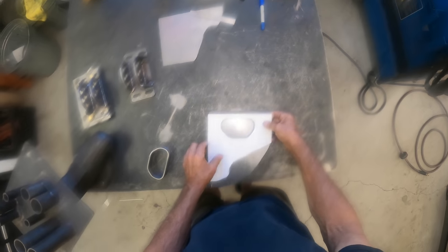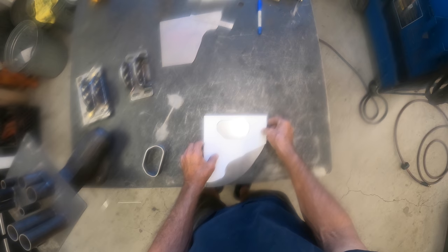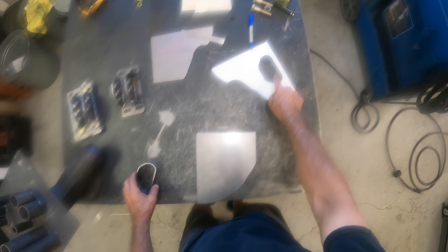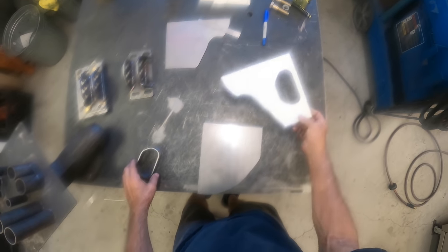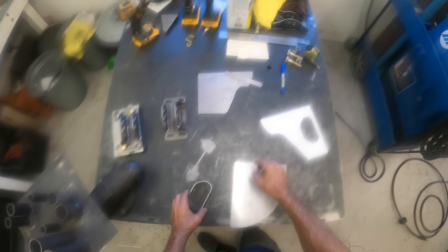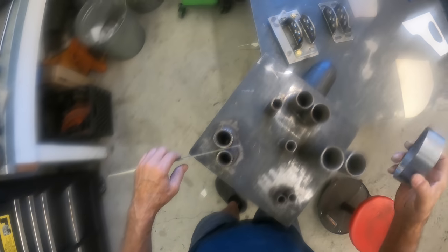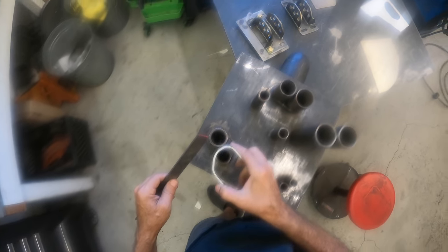Then you draw in the template on a piece of steel. This is an exact template from here, and I'll explain why. So you have something to copy. So you have a rough template to copy. And then you stick the metal in this thing. In this case, this is 1¼ tube, which makes 1½ radius, which is what I was looking for right here.